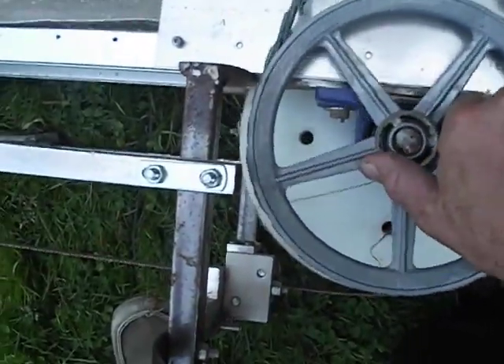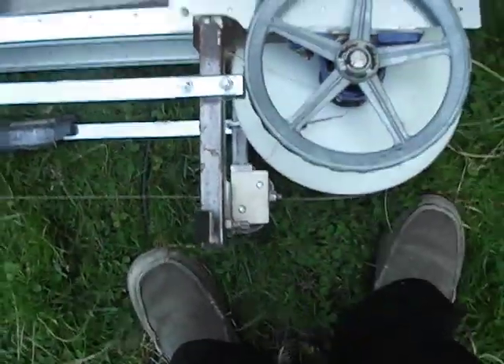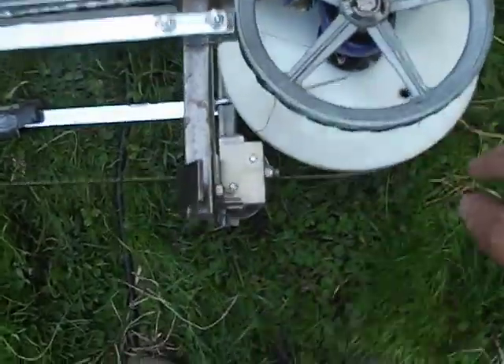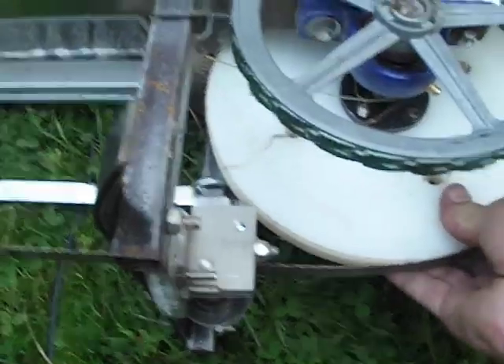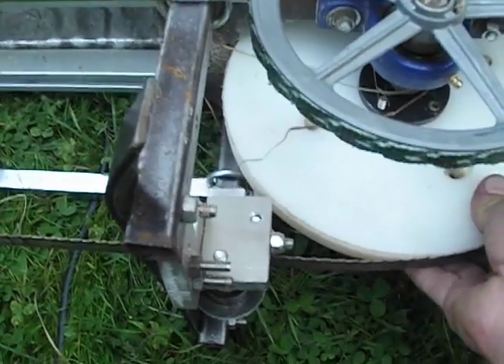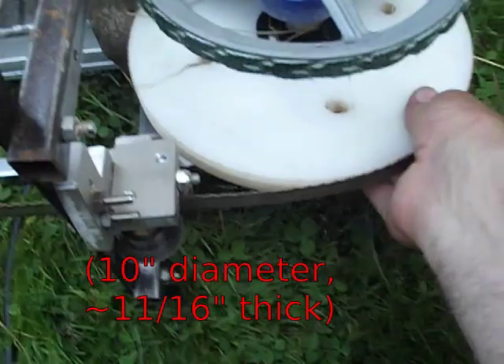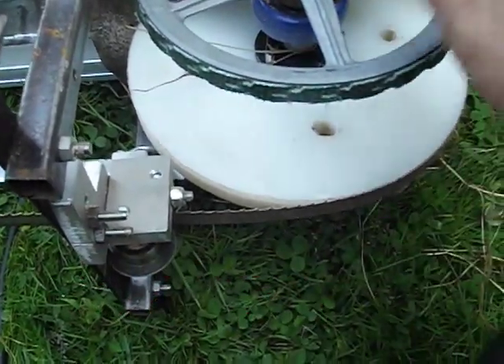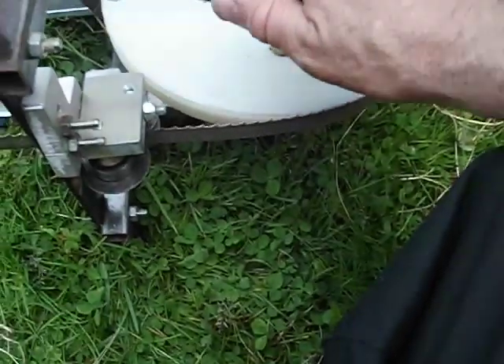I have a link belt here. It's lower friction than the regular V-belt. That's around a two-inch pulley and an eight-inch pulley. The band wheels are made of UHMW — that's ultra-high molecular weight polyethylene — and it happens to be very slippery.